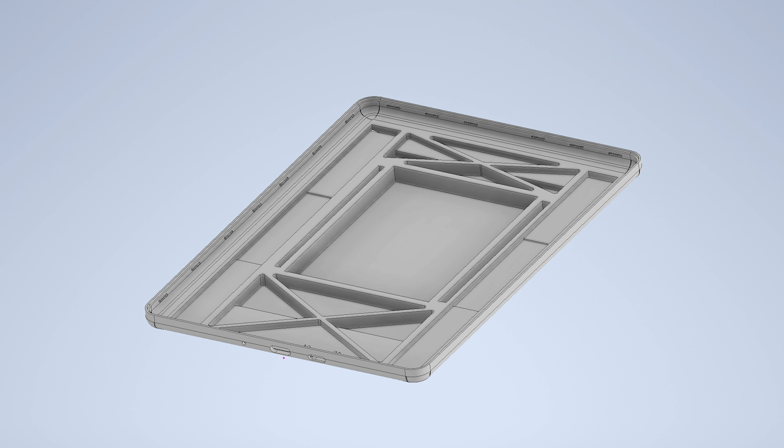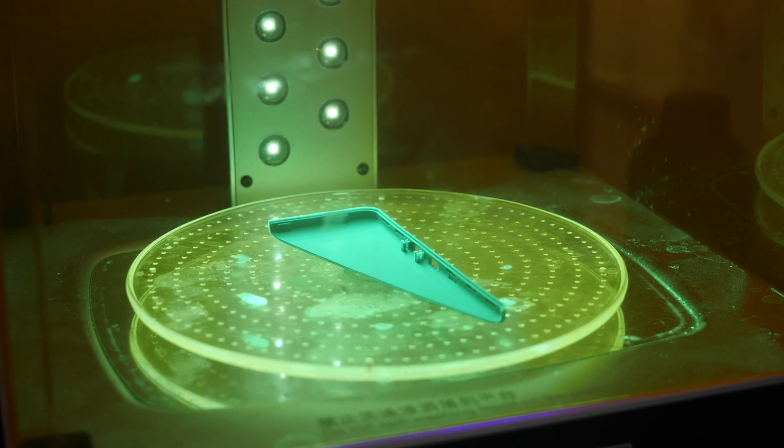Finally, after days and days of tearing my hair out, I had to admit the truth: 3D scanners suck and they aren't suitable for anything except figurines. That admission led me back to my roots and I decided to model the enclosure from scratch. Just like in the good old days, I took measurements with a cheap pair of digital calipers and a lot of trial and error. I printed several iterations of the design at home and ordered professional prints — those included resin, MJF, and SLS printed versions. I found that standard resin worked the best. It has a smooth finish with minimal warping and shrinkage, though I think it would be stronger with a tiny bit of flexible resin mixed in.